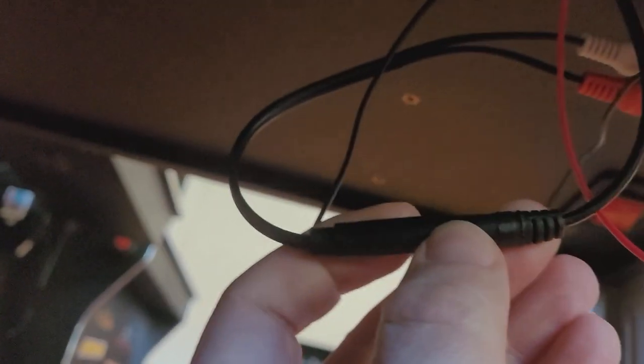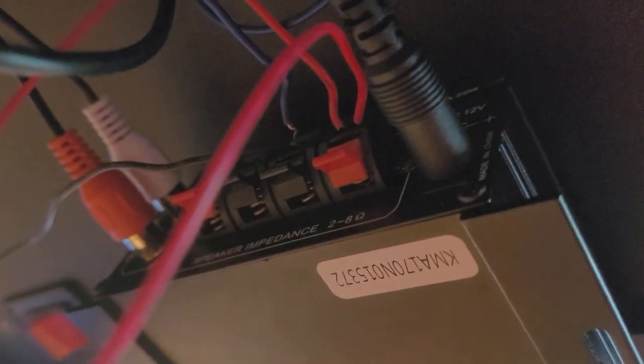There's the wire to the aux connectors right here, and then there is an aux to RCA running into the amp. On the left channel I'm running two sets of red and two sets of black. One set of red and black will go to one Dayton Exciter on one side, and the other will go to the other side. The important thing is they both are going into the left channel — there will be no sound coming out of the right channel, so you want to put both in the left channel.